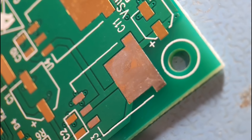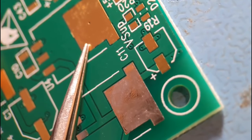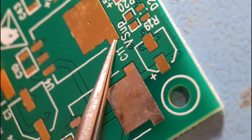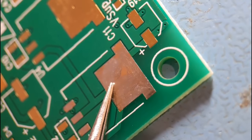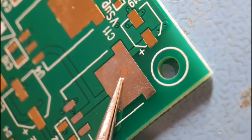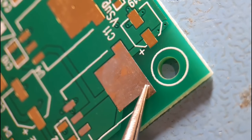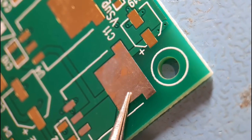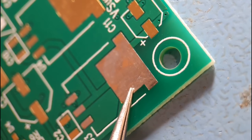We're going to start this next section with a quite large voltage regulator. One end of this component is connected to a ground plane all around it, which makes it difficult to solder - people often just get solder up the end but it doesn't spread across the pad. What I've done is pre-tin the pad with solder and then wicked it all off so it's nice and flat. When you solder the end it will more easily spread under the body and join the pad underneath. If you're struggling to get solder to go beyond the end, tin it first, wick it off, and it'll make life a lot easier.